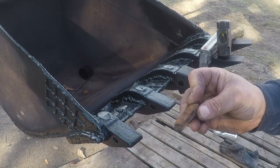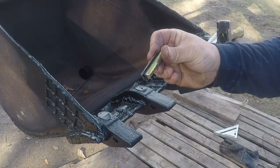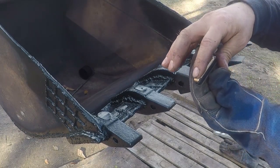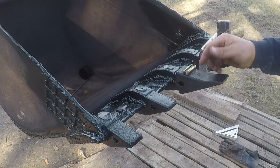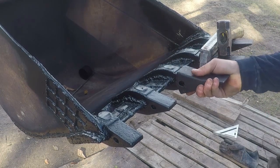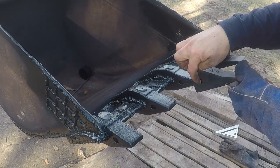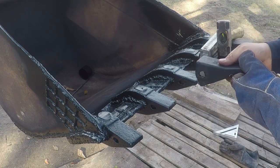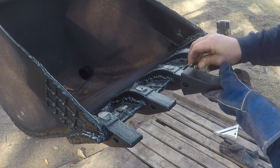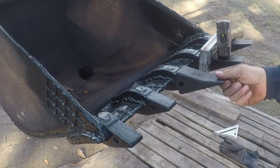This over here, the old pin, it's in bad shape. I bought a new one. As you see, this comes with a smooth side and a side with ridges over here, or latches. This will go like this, the latches to the front and the smooth side to the back. The reason is these teeth over here, when you push them against the shank, they don't perfectly line up. This will stay, I'm exaggerating now, it's going to be like this. And when you push this pin, it's going to push the teeth against the shank to keep it tight so it doesn't play around.